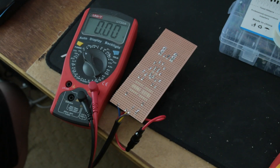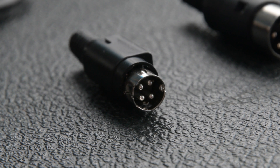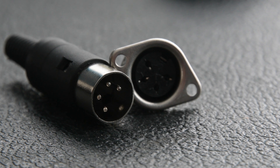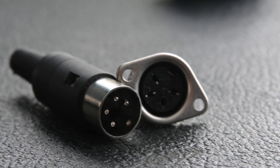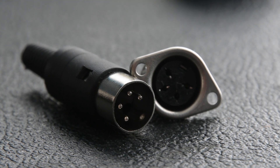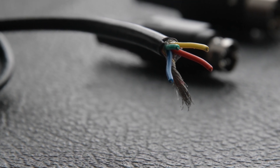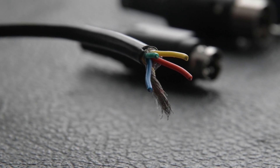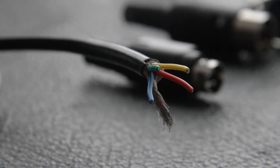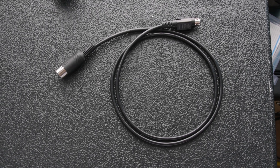I do need to make a better enclosure for it and put on some better cables, but that's the next step. I've got this connector here — I'll put the details in the description — and this is the one required to fit into the Rhodes Mark 7 preamp. On the other end I'm using a DIN 4 connector, which maybe wasn't the best idea as that's used on the Mark 1 suitcase. I've used some wire from a CNC machine as it has four different wires inside, which allows me to create a nice wire between my power supply and the piano.